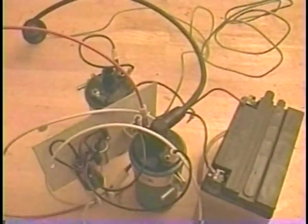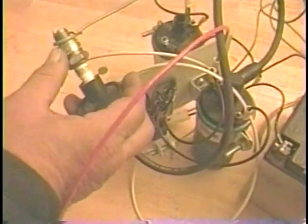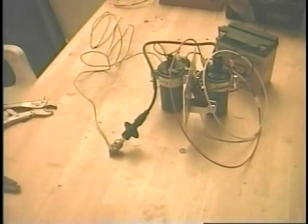And I think what I'm trying to show here is how, well, there we got it all together. Now, it looks like quite a mess there, but once you get it all hooked onto your flying vehicle or whatever you're going to use, all that mess kind of goes away. Make sure that you have the spark plug or motor grounded, because if you don't, that spark is going to go through you, through the handlebars and right through you, and you can feel it, and it's not a pleasant feeling.